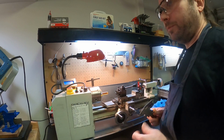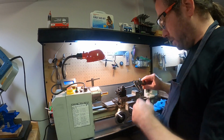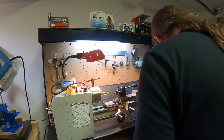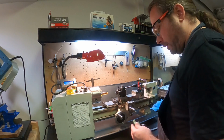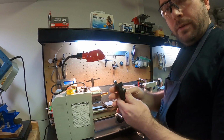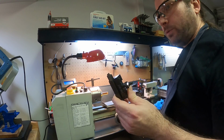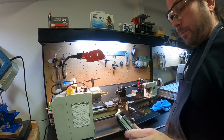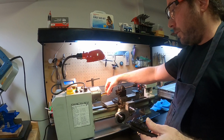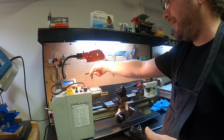The coils themselves, the bobbins, should be about 3.2 millimeters thick. The other thing you need to consider is, to make these, I use a tool like this. It's what's called a parting or a slotting tool. And in fact, we're going to use it for both. We're going to use it to make the slots in this part where we're going to wind the enamel wire.